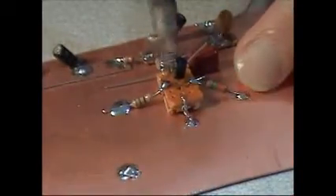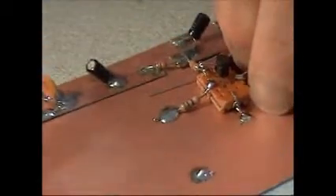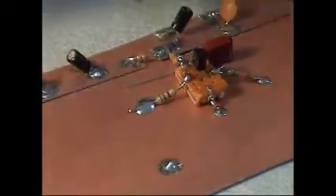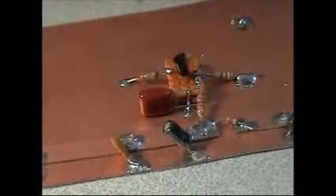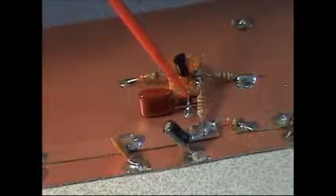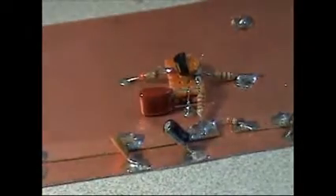It really has a much higher voltage rating than it needs. As long as you have a capacitor that is at least 16 volts, you can use it in this part of the circuit. A 50 volt size is fine — it just takes up a little more space, physically larger than it needs to be. I clipped off the excess lead length. We have one lead of the capacitor going to the drain lead of the FET, and then the other lead is soldered down onto the ground plane of the circuit board.